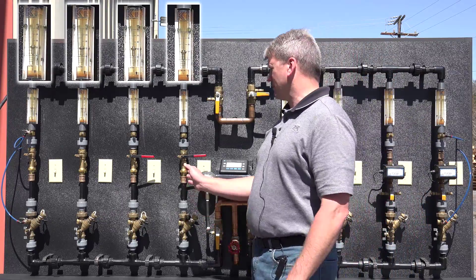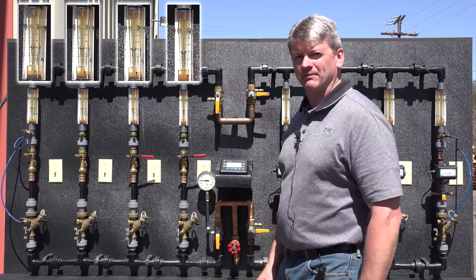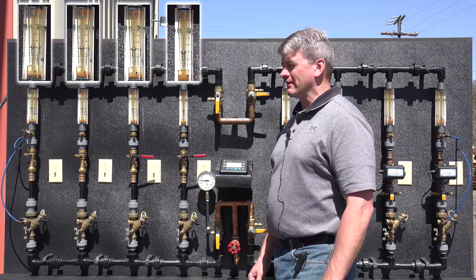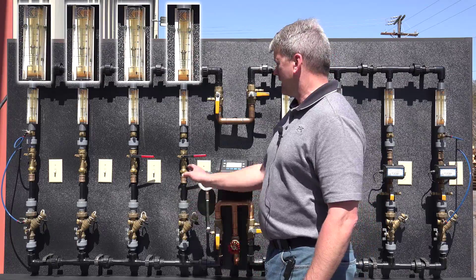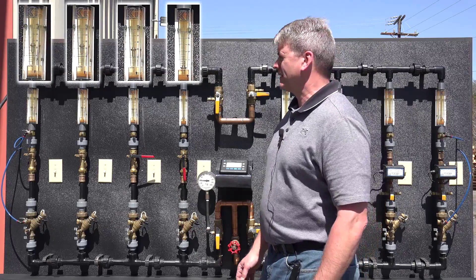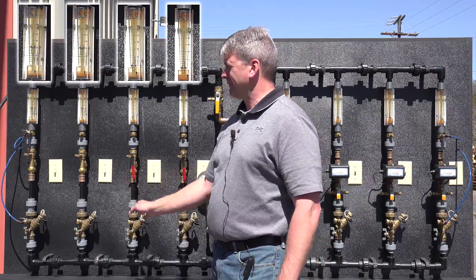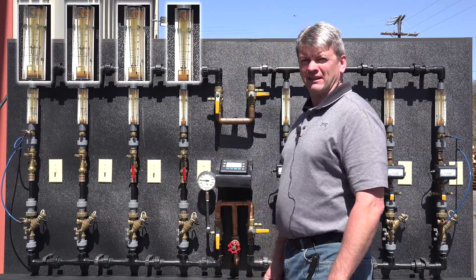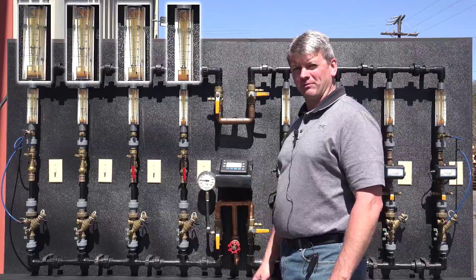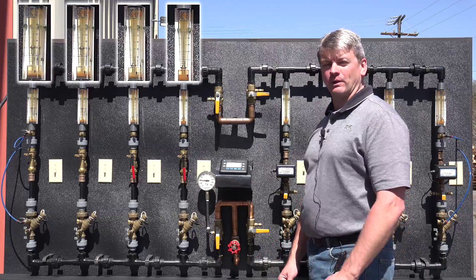I will say one thing — we're using Hays combination valves for the demonstration. We do not have the electronic actuators on them for ease; I'm going to use a manual lever arm to turn off the valve. Similar to what we showed on the manual side, as comfort gets met and the thermostat turns off, with automatic balancing we've held our 2 GPM set point. We turn off another branch, and again the automatic valves adjust and balance the flow. Now we're at design flow to all open branches, meeting our comfort requirement, with additional energy savings by not overflowing the pump.